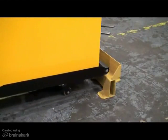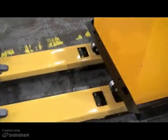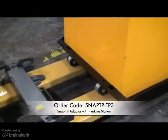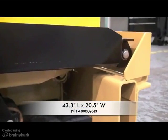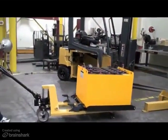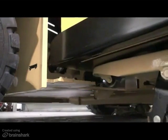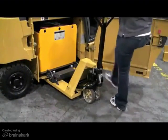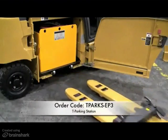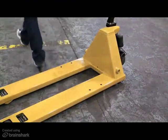It's important to note that this is a no-charge option — you only receive a four-roller trolley when ordering this configuration. In order to use this option, you need to separately order a SnapFit adapter with T-Parking Station, as well as a manual pallet jack. The recommended size is 43.3-inch long forks with 20.5 inches in overall width. Please note that your dealership will be responsible for drilling the holes in the pallet jack so the SnapFit mechanism can be attached. A template and instructions are included with each order. You will also need to order an additional T-Parking Station and four-roller trolley for each additional battery to be used with the truck. If the customer is already using the SnapFit method in their operation, you can order the T-Parking Station as a standalone option. Also note that the SnapFit adapter can easily be removed from the pallet jack, enabling it to be used for other purposes throughout the facility.